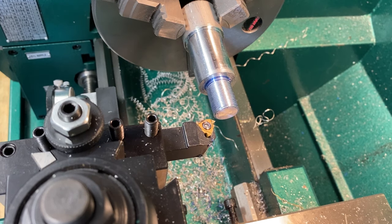I'm going to get some confidence and watch the indicator, let it come up as close to zero as possible — if we crash it, we crash it. I'll bring it back up to zero and add a couple of thou — 4 thou. That comes up on that quick. I'm going to bump it forward again using the inching. I just touched that face. But that's okay, we'll clean it up. I'll try some anchor lube a little later. Let's give it 4 or 5 more thou — there's just not a lot of thread in the bowl for relief, so I've got to get it a little closer.